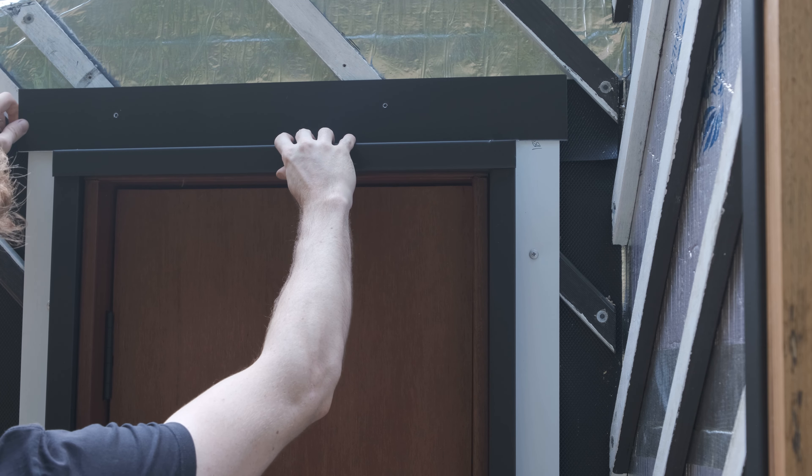The roof of this box starts with eave flashings that another type of flashing will sit on top of. I ended up cutting and bending a completely custom piece for the joint at the back of this roof — it covers the tops of the corner flashings and a hole that would have been behind the panels near the edges of the wall. I was completely unsure of myself making this piece so I didn't film it, but it did end up being pretty good if I do say so myself. These pieces that go on top of the eave flashings act as a receiver for the roof panels. I put butyl tape on them so that any water that gets underneath can't travel back up into the roof.